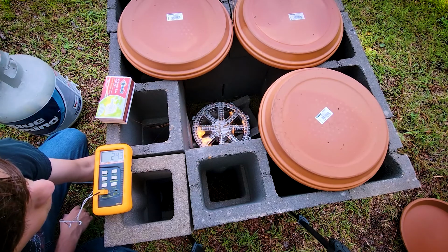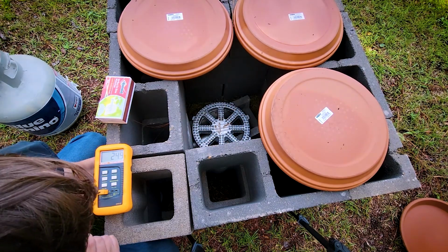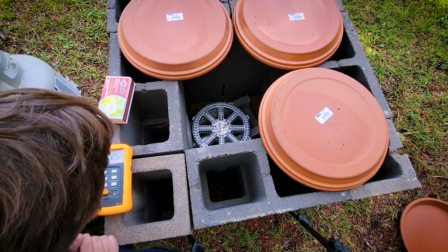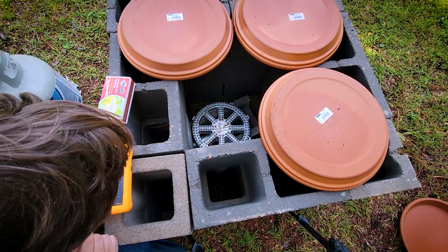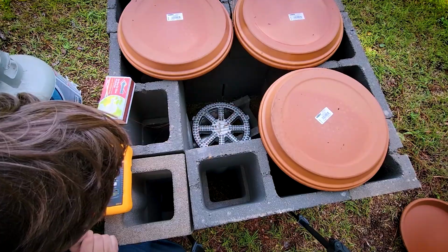That took a good bit of playing around with, and eventually I thought I had a problem where the gas wasn't getting enough oxygen to burn. The idea behind that was that there were some violent pops happening every so often, which I thought was a whole bunch of unused gas suddenly almost exploding, and the temperatures being super low as a result of not burning all of the gas that I was putting in there.